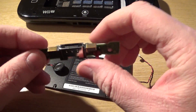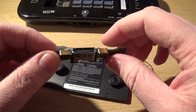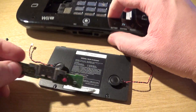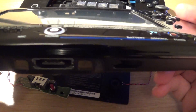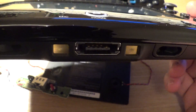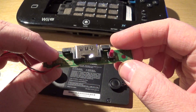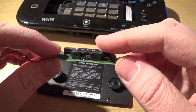This little connector here — in the actual Wii U gamepad, all you really use are these two gold contacts if you get the charging dock. We've got this weird proprietary connector on here — of course it would be proprietary. These two gold contacts are used just for charging. The only other thing on this little board actually in use is just this synchronise button here, to synchronise with the console itself.